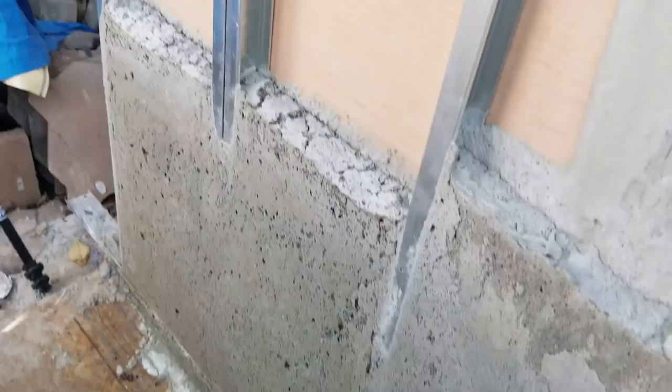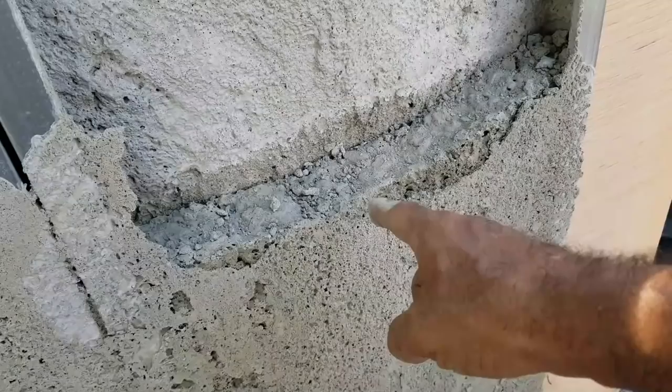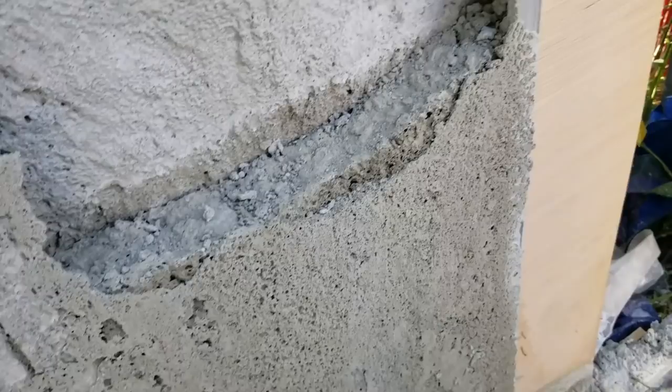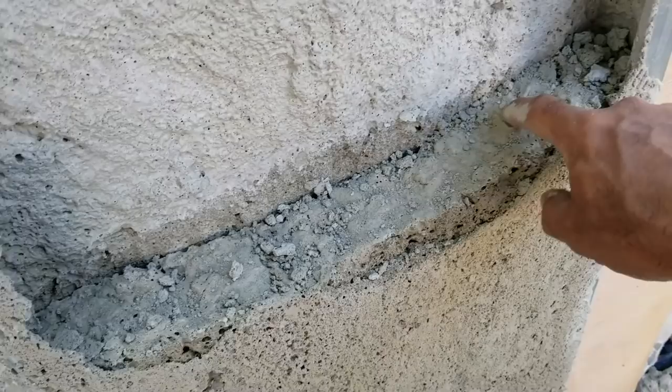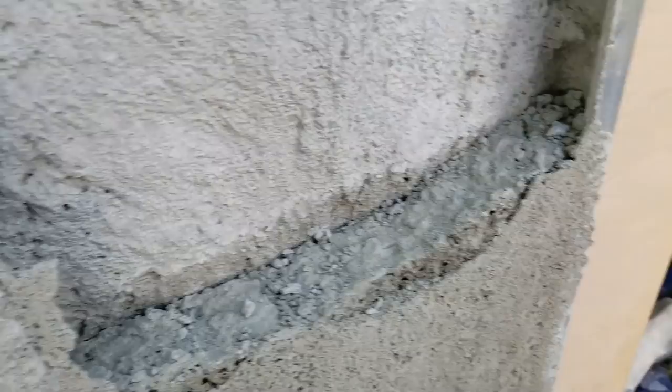As you can see right here, if you look at this piece, the aircrete is solid because this was a denser mix. This last mix on top was 60 gallons. What I would recommend for insulation would be mixing a 94-pound bag in a 100-gallon container — that would work great for insulation made with aircrete.